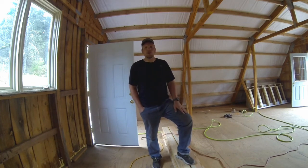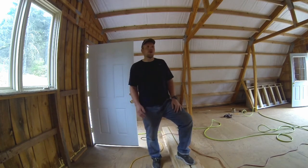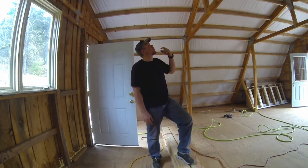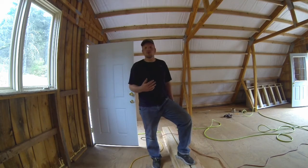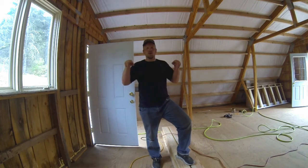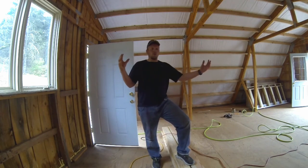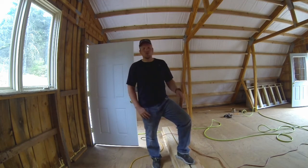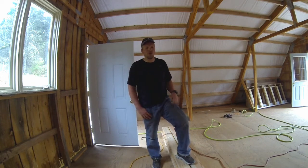This week too, me and my dad got all this done, which you'll see in the videos. All the box framing. What I'm doing tonight is just up here putting in the joist nails that hold the board in on those joist hangers. So it's like 4 on each side of the board. So I'm just knocking those out with my little tool. That tool saved us so much time. Excellent little tool for 40 bucks. That little air hammer was great.